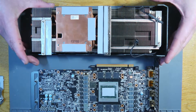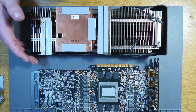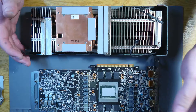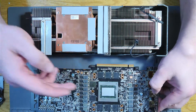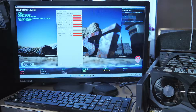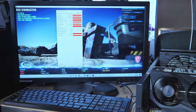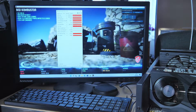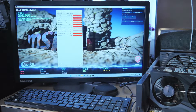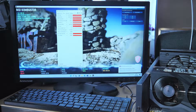A quick look at the card before we close it up — we've got a new set of pads all the way around, from the VRMs all the way through to the VRAM, and we've also given it a fresh coat of paste. The card is ready to be closed up and we'll test it again from there. The card's been on test for a few minutes and everything seems to be running perfectly fine. The temperatures are pretty normal for a 6800 XT, and we're going to move it onto our 4K rig for better testing. So far this repair looks like it's all good.